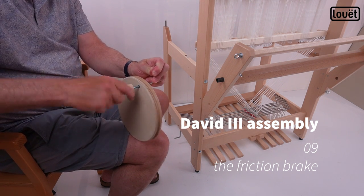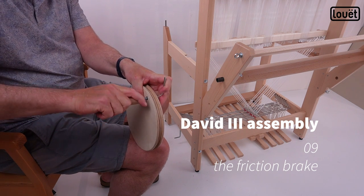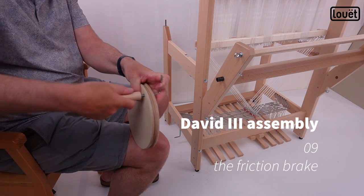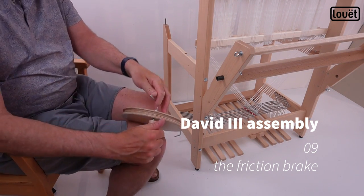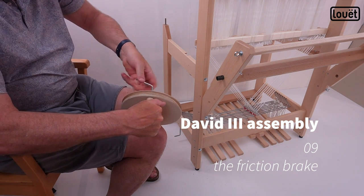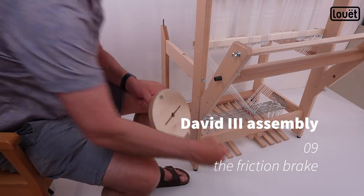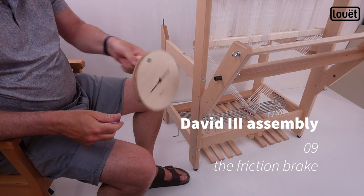But you're creating a thread as you're turning, so it is advisable not to unscrew this at all, because then you can lose your position in the threading and it'll strip pretty quickly. There's a long bolt here, there's a lot of thread. That's how this gets secure and doesn't come loose. Now it's getting a little tougher to turn the handle, so the Allen wrench becomes easier to turn. Nice and snug, and the handle will work just fine.